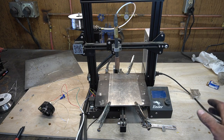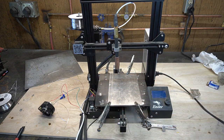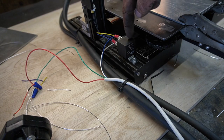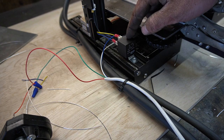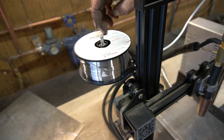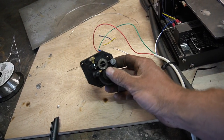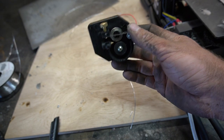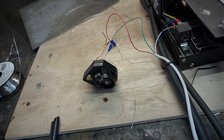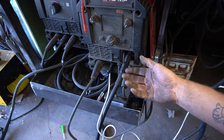I snuck off for a second to figure out all the electronic stuff. Everything is just about the same as you last saw it — the only change is I've added a relay. I've meticulously picked through the firmware and removed anything regarding the heated bed or the hot end. I've wired a relay to one of the fan outputs, and this relay is what triggers the welder — we can send an M106 to turn it on and an M107 to turn it off. I've loaded a spool of ER5356 wire for welding aluminum. On the other end you can see the old spool from the welder, mostly because I don't want to modify my welder or run it expecting a load and not getting one. These lines are all hooked up to the welder — this is for the trigger, this is ground.